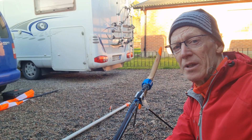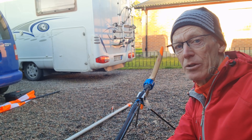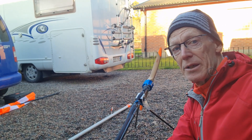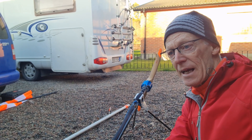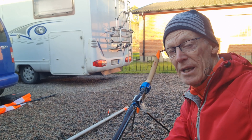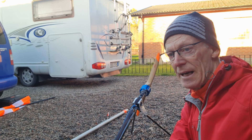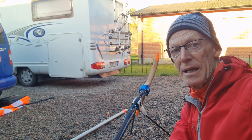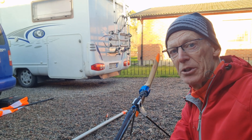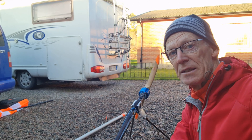Maybe 18,000 mAh could be even better. The power — as you see when I do the takeoff — the static power is not as much as on the Mosquito because they have a bigger prop. But the climb is absolutely okay for this kind of light equipment that helps you get up to the thermals. I say this is good enough.